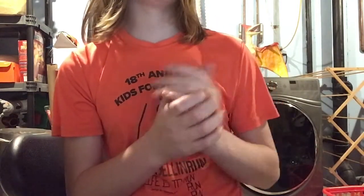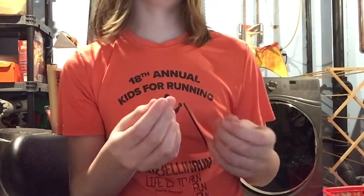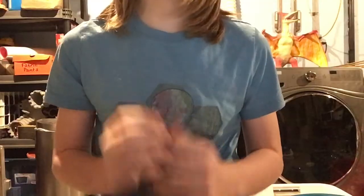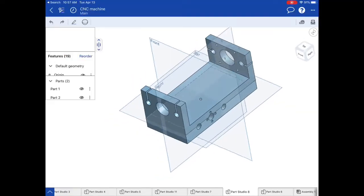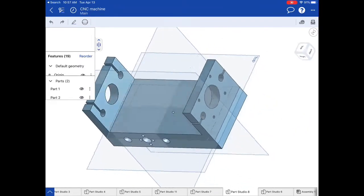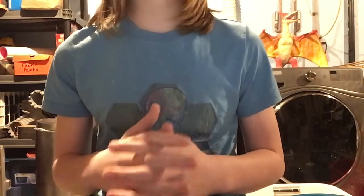Put the guiding rod through the part and into both clamps, then insert the lead screw back into the bearing. The part for the other side is pretty much the same installation-wise, but instead of a spot for the stepper motor, there's a spot for another 608ZZ bearing. The last step is to spin the two sides until they are parallel with each other, so when you add the axis coming between the two it's as straight as possible. Before we start on the X-axis, print the Z-axis carriage — the largest 3D print in the entire build. Its job is to move linearly along the X-axis and hold the bearings and stepper motor for the Z-axis. Add the brass nut, screw it onto the lead screw, press-fit the coupler onto the stepper motor, hammer in the lead screw, then insert the guiding rods. Now the two axes are done.